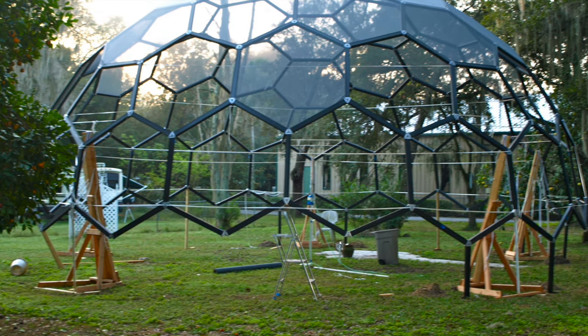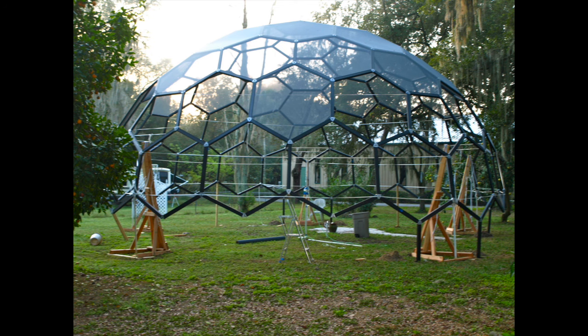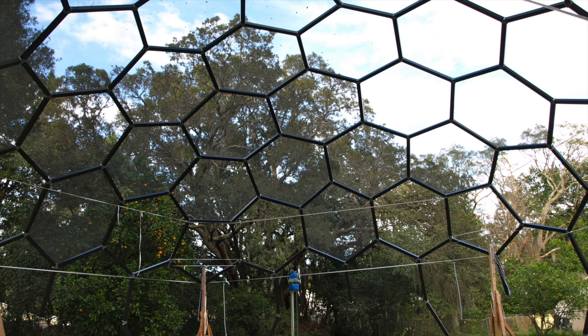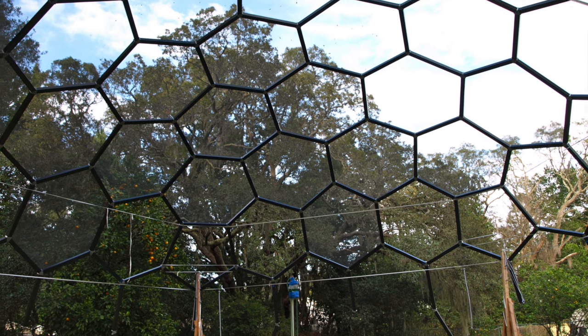As the dome increases in size, the ease of screening large panels increases because the outer wall becomes more vertical. There is more weight on each bungee, and averaging four or five bungees on a jack stand makes tying off and raising sequences easier. As the dome increases in size, raising the dome in more gradual increments is preferred. It slows the process but evens out possible stressing.